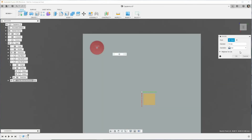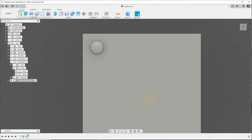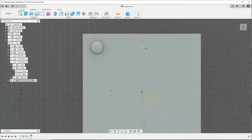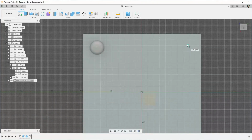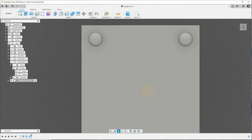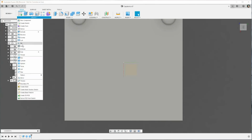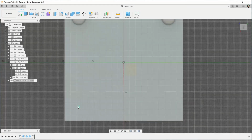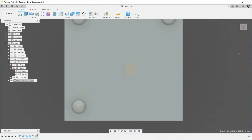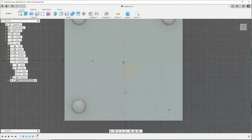So we just drive that, make sure that we're joining so it's making a little sphere on the top, and we just repeat that over on each side. So I'm doing it evenly on all four corners. You could have different sizes, so the mold only goes together one way. That's quite common, but if you do it the same way, it should fit together any way you want it to. I often make a mark on the side of the outside of the mold with a Sharpie, just to tell myself how the mold fits together.